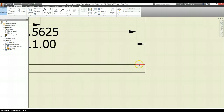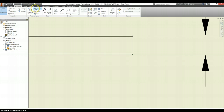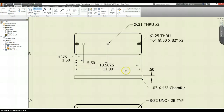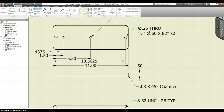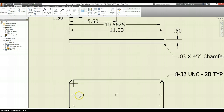We need to get the overall thickness in here. And there's also this little chamfer — you have a chamfer note. Click on the angled edge first, and then a side view, and drop it in place. Now's a good time to remind you that any time you have something that looks like a circle, you should be using a center mark to locate where the center of that circle is, which is going to make these much easier to dimension, as they are also the center of these.